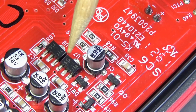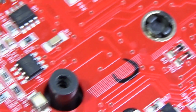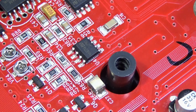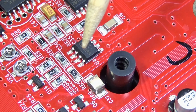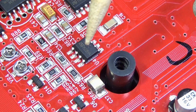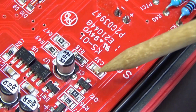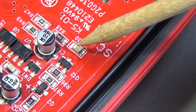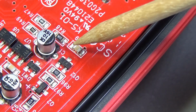And it comes out from the regulator. Can a path be that close to the ground? Do you remember, for each chip we got, we always add a 0.1 microfarad capacitor to suppress the noise between the positive and the negative. Am I right? This capacitor is to suppress the noise. The typical 0.1 microfarads. One side goes to ground and the other goes to the positive.